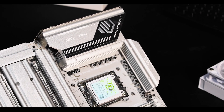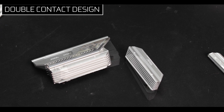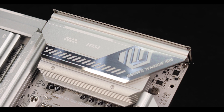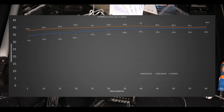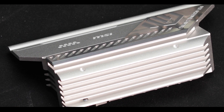Cooling-wise, the VRM comes equipped with tall, dense, beautiful cooling blocks, both with double contact designs — important to keep power stages and chokes under constant heat removal. In addition, we also have a large extended roof for fast heat dissipation. I did run the mandatory thermal test and, staying very close to its Tomahawk X870E sibling, it gave me stellar results with heat saturation emerging at minute 18, pointing at a very dense and pure aluminum alloy indeed.